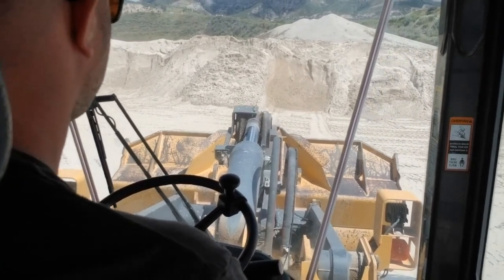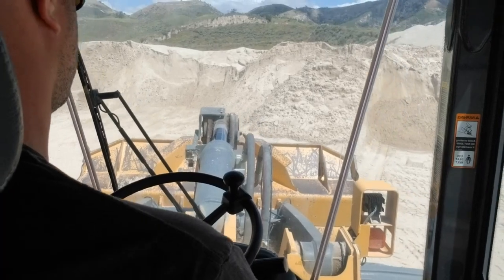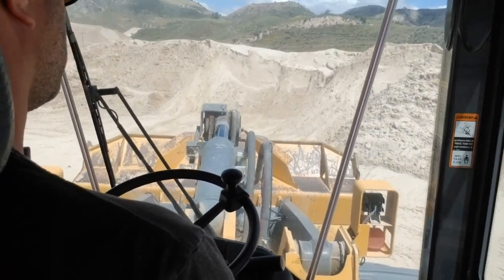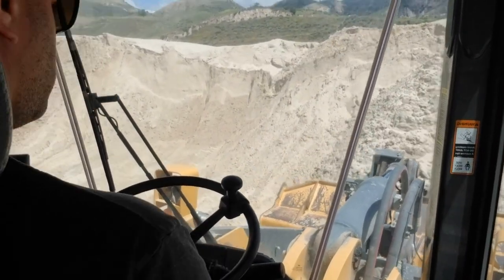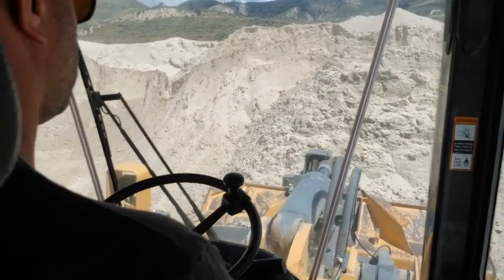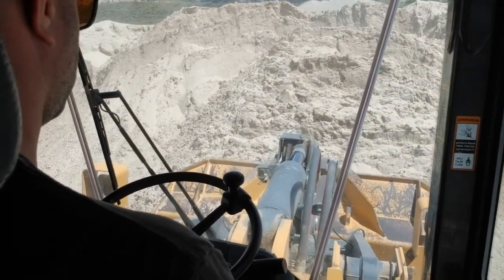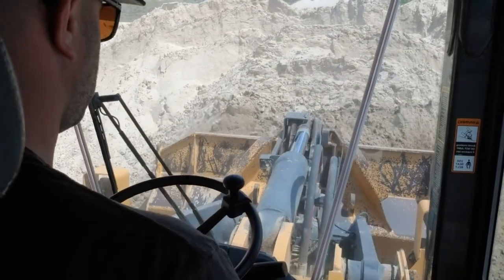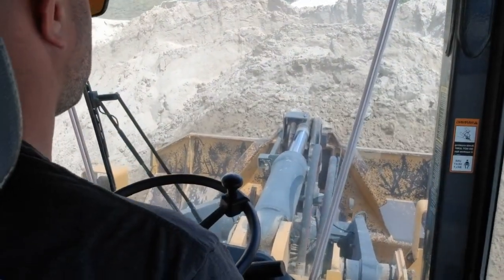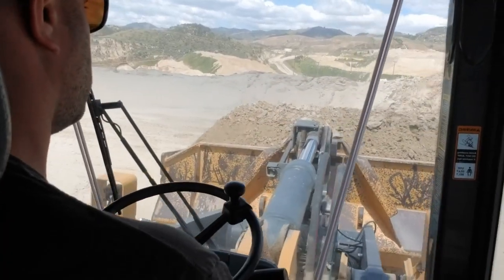Here's what it looks like from our point of view — reverse back. See that spot where I just went into? Now if you really want to get a better, bigger bucket, find the fluffy spots. Don't keep digging into the same safe spot — find a corner. See how it's fluffing down like that? That's how you get good big buckets and be efficient with your time. Look at that bucket.